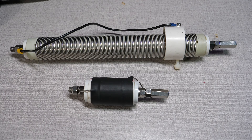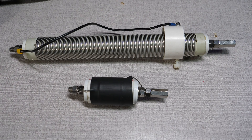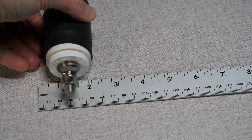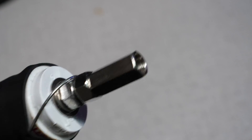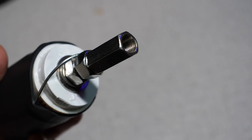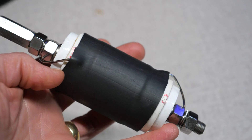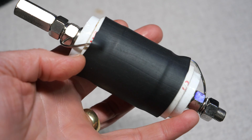Looking at the Sporty 40 coil, the unit is small — much smaller than the Silver Bullet 1000, or even the Silver Bullet Mini. The Sporty 40 coil measures 6.5 inches long by 2 inches wide and weighs about 9 ounces. Construction is similar to the larger coils: a stainless steel wire is wrapped around a plastic core, and there are 3/8 x 24 studs on the bottom and the top. The bottom screws into a stand or a stake, and the whip screws into the top. The coil is wrapped with a heavy-duty shrink wrap for protection.